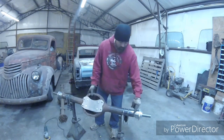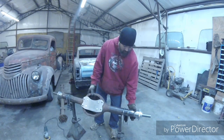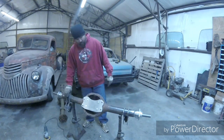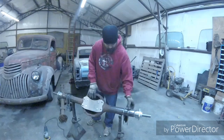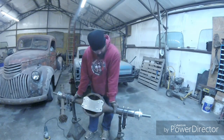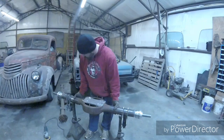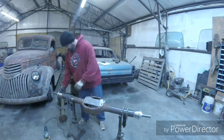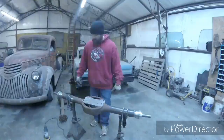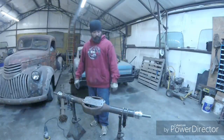While I had it apart, I ground the end of the housing — that way we can get good penetration on the weld all the way around. I'll show you more of that in a minute. Now everything's lined up and we can start doing a few tacks here and there to hold it all in place, then we can do our full fillet weld all the way around.